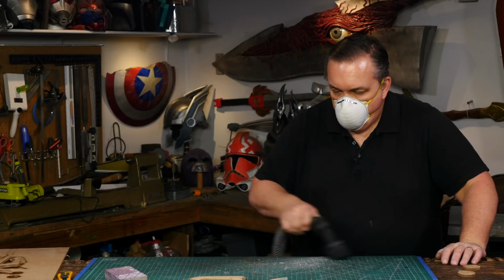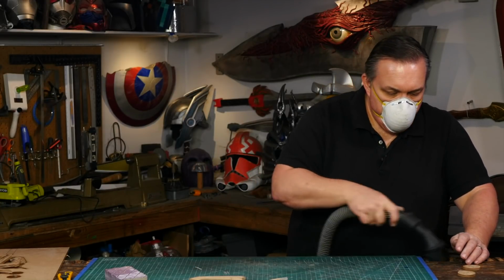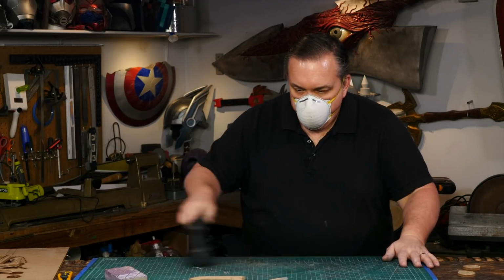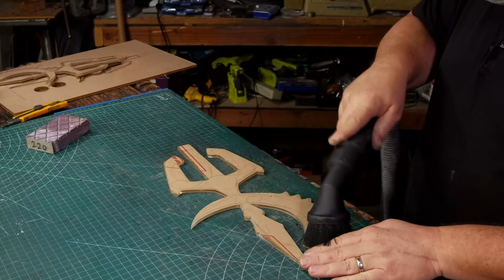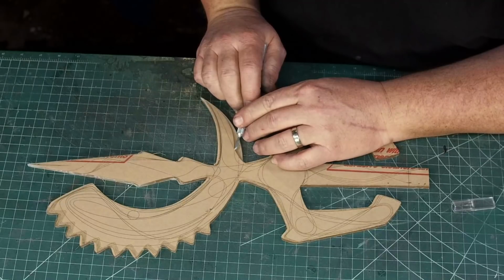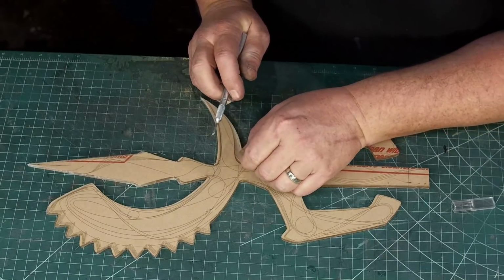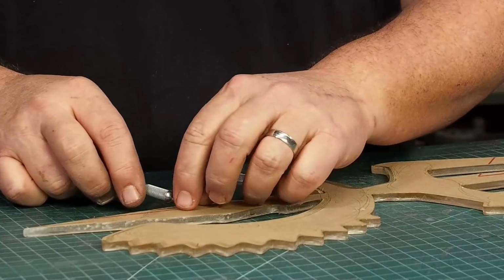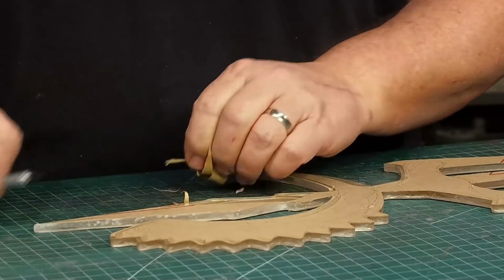When working with plastic, keep the workspace as clean as you can. All the shavings and that plastic sawdust will scratch the surface of the plastic you're working with. I find using a vacuum is easier than fixing small scratches on my plastic project. Another reason to clean is when you start to remove the protective wrap for the plastic, that can create static cling, and all those little tiny bits of stuff that you don't want are suddenly attracted to your project.